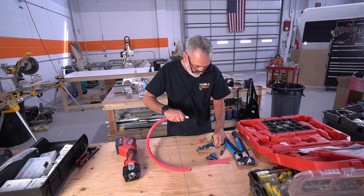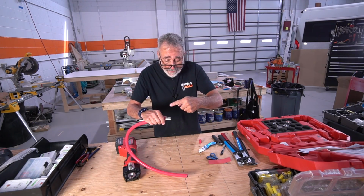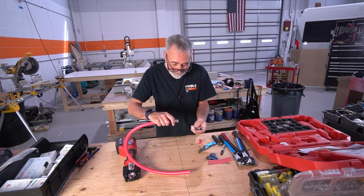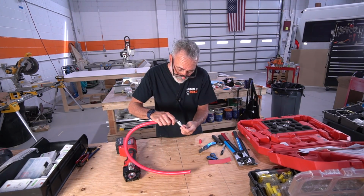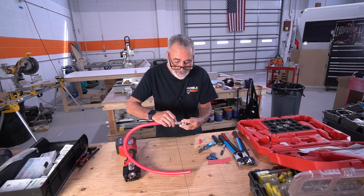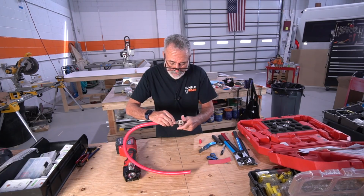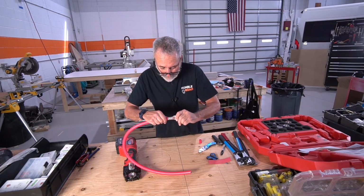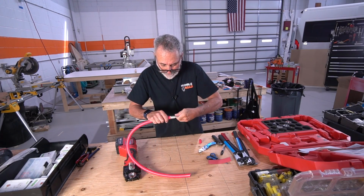I lost one. The wires have a spiral, the way they go through the jacket. Follow that spiral. You kind of put your lug on from one side and spin it on. Make sure every strand is inside that lug, okay?